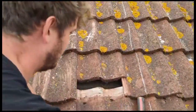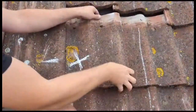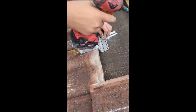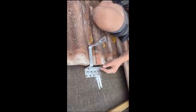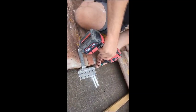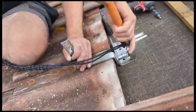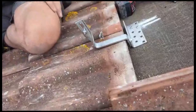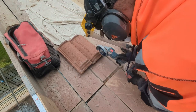We can see Matty Marnus' gloves knocking the existing tiles out the way — he's just going to lift the one we need to grind the back out of. These are only loosely nailed down; it's just so the roofers can keep everything in a line, they're not really a fixing as such. He's going to get that out the way and pop the bracket down. These are bulk brackets, roof hooks — whatever you want to call them — and we're using the wider bulk fixings to secure those in place. Usually you can only get a couple of screws into a rafter due to the width, but if you can get more it is always better. You need to remember to tighten up the nut on the back of these bulk fastenings because they do allow some movement and adjustment — you want to make sure you've got that rock solid and it's sat above the tile below, not in contact with it.